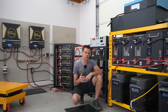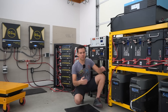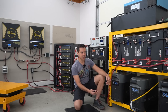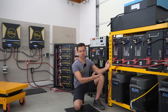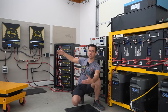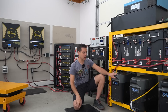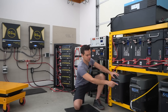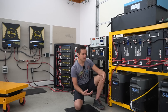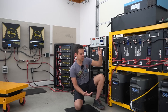The next downside is a huge issue and is what separates a solar generator from a DIY solar power system. When the battery gets too low, it will turn off the inverter and disconnect the loads — that's good. But when solar recharges it back up to 100 percent, it does not turn itself back on again. With DIY inverters and all-in-one units, you can program them to turn on once they get solar. They could add this feature to the firmware so easily — program it to turn on the inverter once it reaches a certain state of charge, whether 20, 80, or 100 percent.